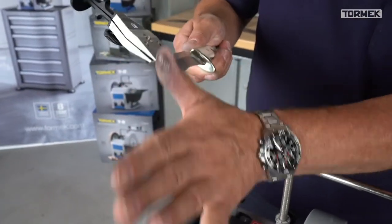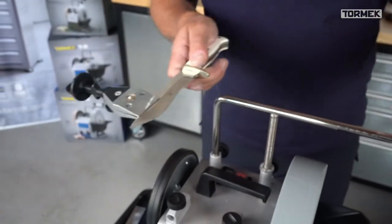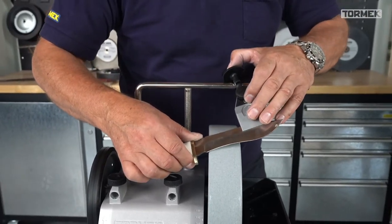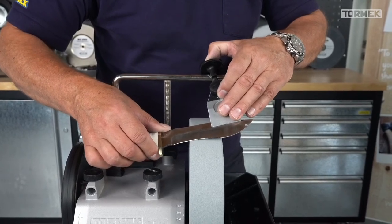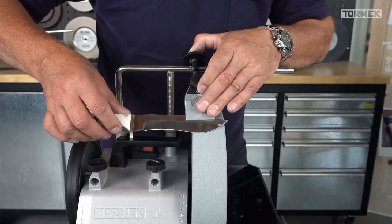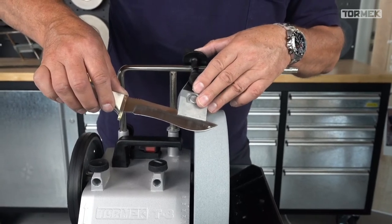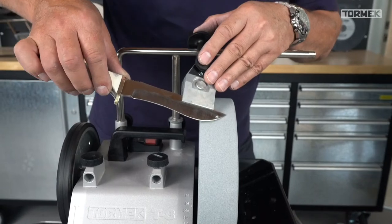As we discuss in our live sessions - when you go to the point you want to lift up the knife to get the tip sharpened. But here on the kukri-style knife when you want to take the curve you have to press the knife down instead, because otherwise you'd have to go up and over but then you'd touch the stone edge. So really go only that way - not digging in - because you'll get more and more deep and it won't look beautiful. I prefer this on the Japanese stone for a nicer finish.